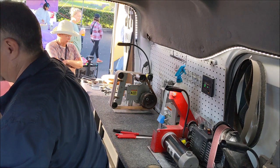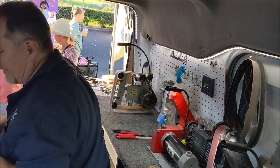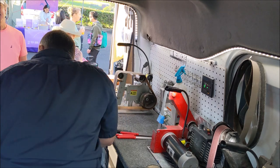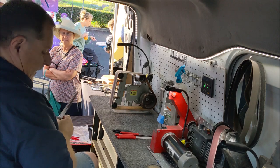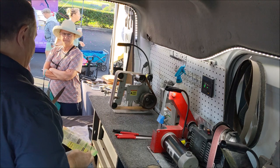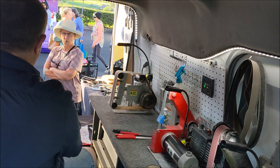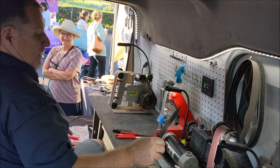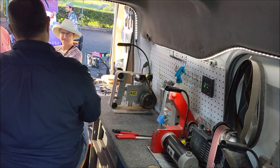I thought I knew what I was doing. Well, you're using stones. Yeah. So if you're going edge leading and that's trailing, then at a certain point I always recommend you finish with a couple light edge leading swipes. And there's different theories, there's different ways people do it. You know, I'm actually doing this to show, using it for examples and stuff, but I don't even test.